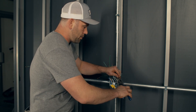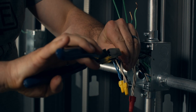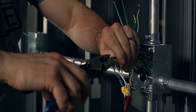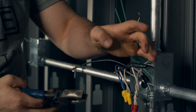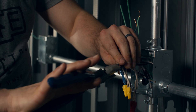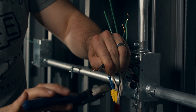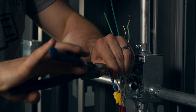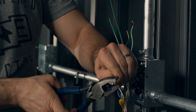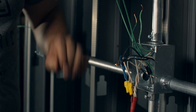Same thing with the black wires. I'm going to make up the black wires just like I would any other solid connection, twisting them very good and tight, pinching them. Sometimes when you're early in your career, this will be very tiresome on your thumbs — you've just got to keep working at it. Nobody got fit in one day. Your hands aren't going to get fit in one day. It's one of the things electricians are known for — that strong grip. Twist the stranded around it, cut it to length, and you have a good connection there.